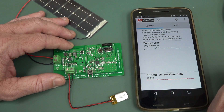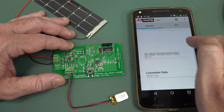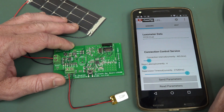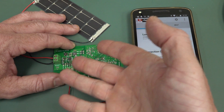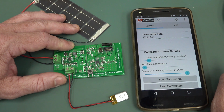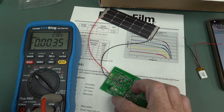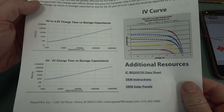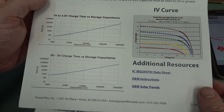I'm sitting here and I don't see this thing really charging at all. Unfortunately, we just can't get much data. The whole point of this is evaluating the solar cells in an energy harvesting application. But it doesn't seem to do much at all. It looks as though we have an option to get rid of the battery and store the charge in a supercap. They've got the charge curves here of time versus storage capacitance.